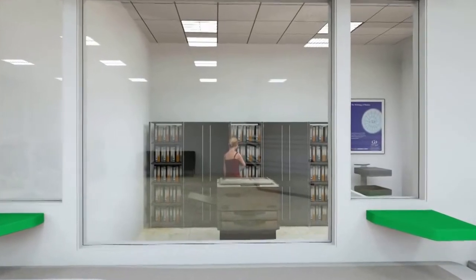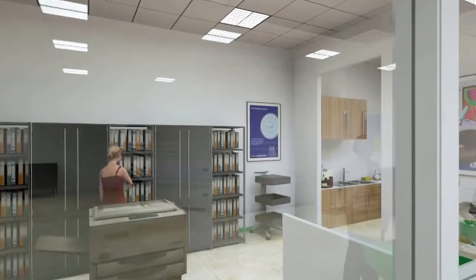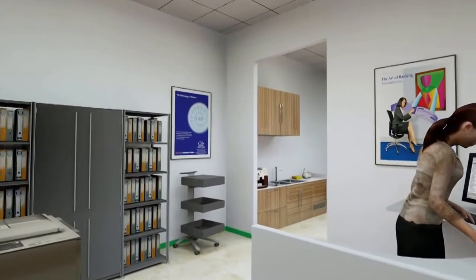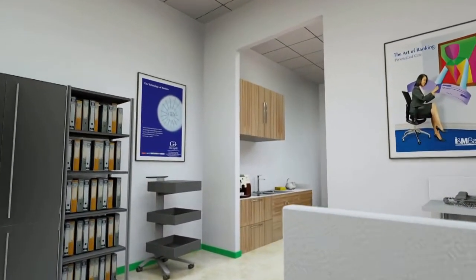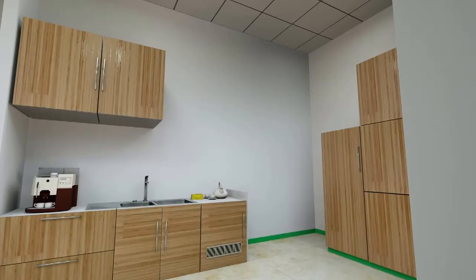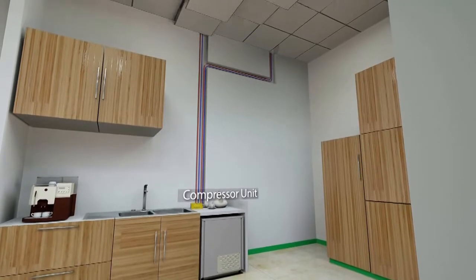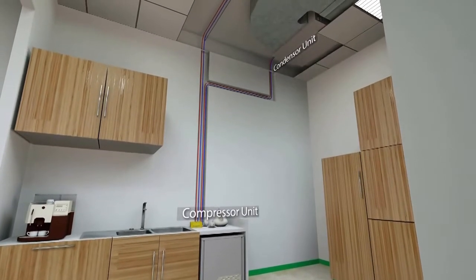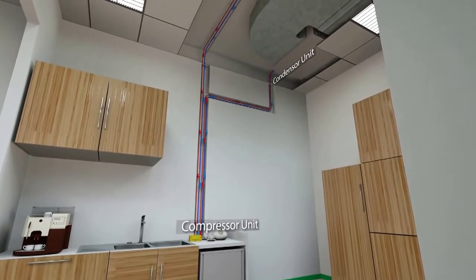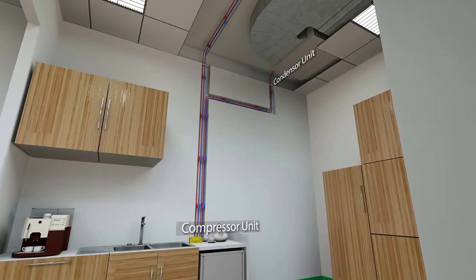But the main challenge for this application was to make the outdoor unit invisible. We combined two major innovations resulting in the most aesthetic and compact installation ever brought on the market. On our VRV4i series, we split up the traditional outdoor unit into a compressor compartment and condenser compartment. This unique approach gives us the flexibility to install the entire outdoor unit indoors.